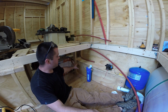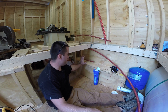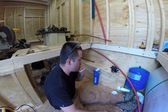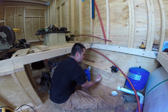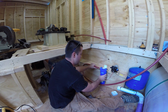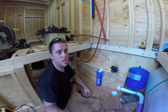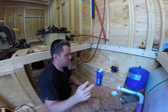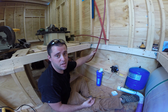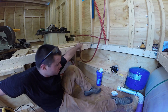Originally I was going to put my electrical panel in my closet, but I think I can position everything — filter, pump, accumulator, battery banks, charge controller — all right here. I'll nail a 2x6 on here and mount it all onto that. I bought red three-quarter PEX for the main feed and blue half-inch because that's all they had in stock. It doesn't matter what runs through the pipe — hot or cold water, they're the exact same pipe. The red just tells you it's the hot line and the blue is the cold line.